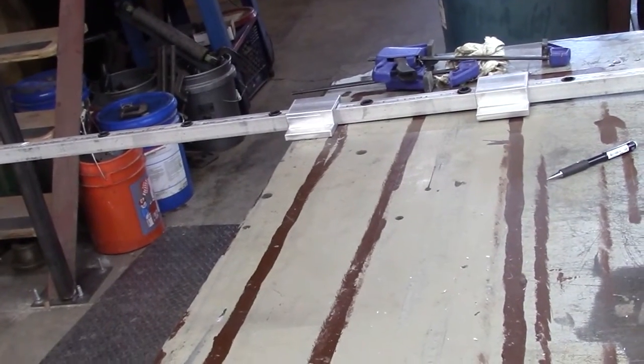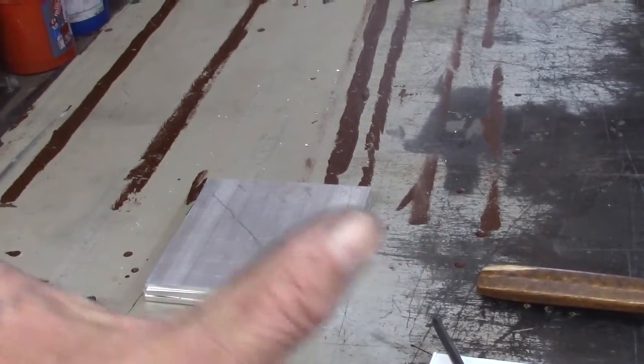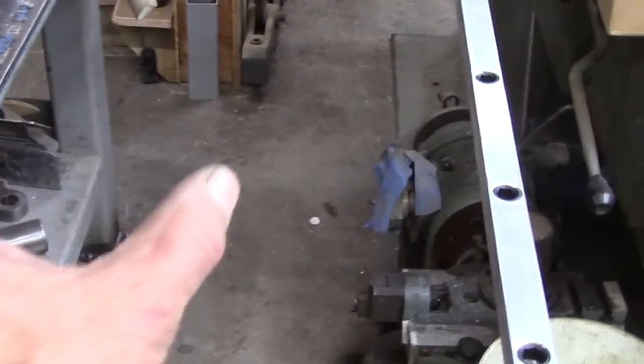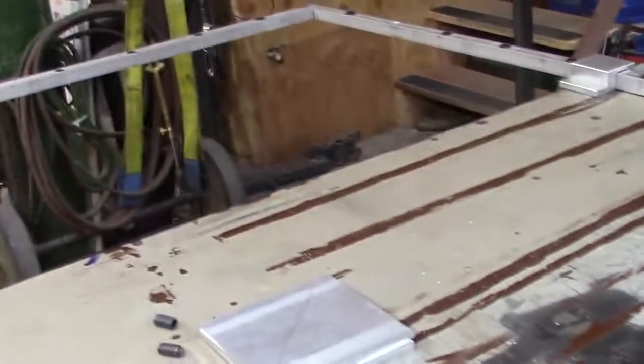And then we have two more down here, because sometimes you have doors with louvers and vision kits, so you can set up your width for your louver and your width for your vision kit, or heights rather. And then this and that sets the width of them. And then the pin router will run between those 1/4 by 3 blades and the pattern that they set up on this jig.